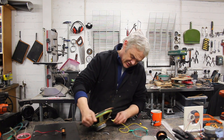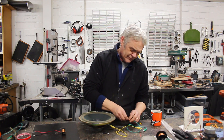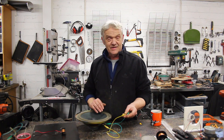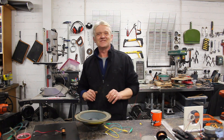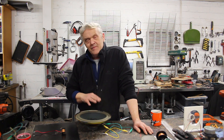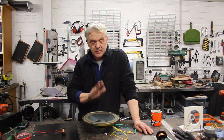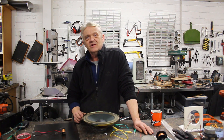If I just straightforwardly connect this to my coil in the loudspeaker — we don't need to do anything else apart from connect it up. If we tap that hard enough that LED will light. Now it's not producing very much, because the coil is really small and the magnetic field is really small. The only thing we could change on that, if we were to use one of these as a generator, is the speed. I'm tapping it relatively slowly — if I were to tap it quickly, five or six hundred times a second, we'd actually get quite good generation.